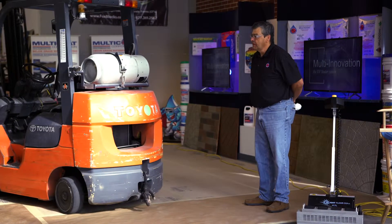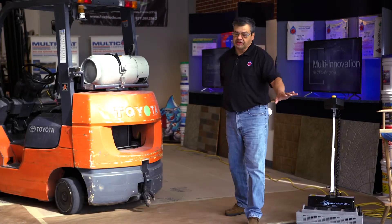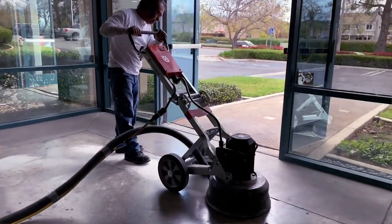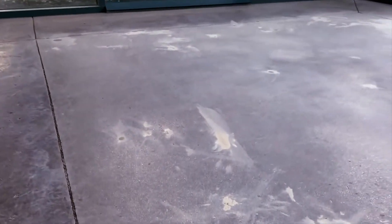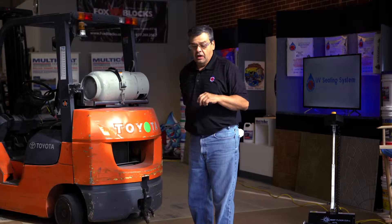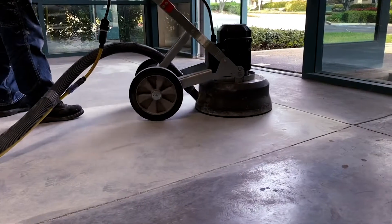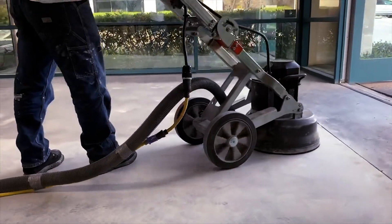We have a two-coat system. We took videos yesterday morning of the steps it took to get to where we're at right now, which is basically a two-step grind process. One was a rough grind — 50 grit diamond — and once we completely roughed up the surface, we came back with a multi-coat product called Vapor Shield Densifier. Two coats of that were applied with water, so we allowed that to cure and fully dry. Then we came back with a 100 grit diamond finishing grind to remove any residue left on the surface from the Vapor Shield. As you see now, the floor is ready to go.